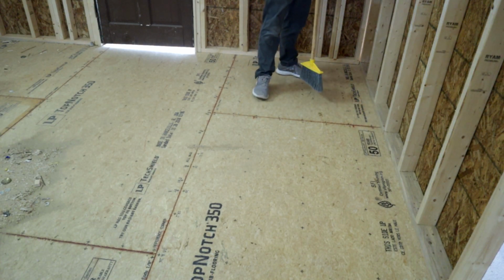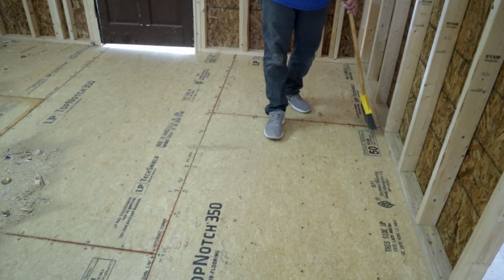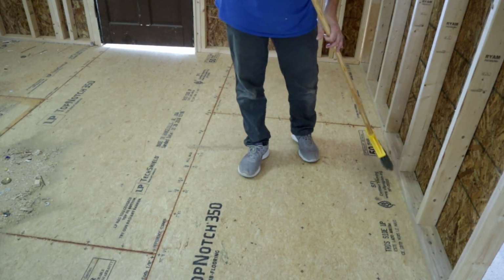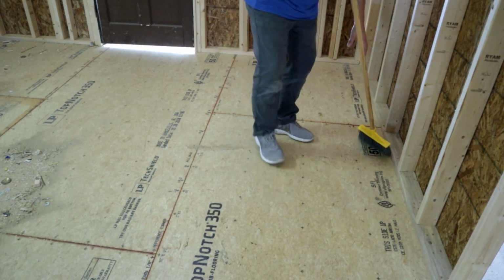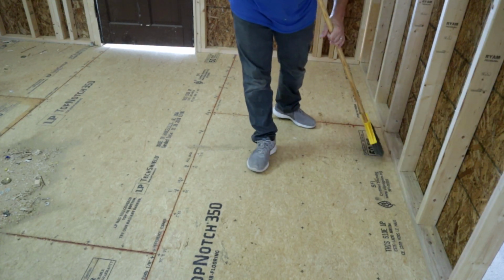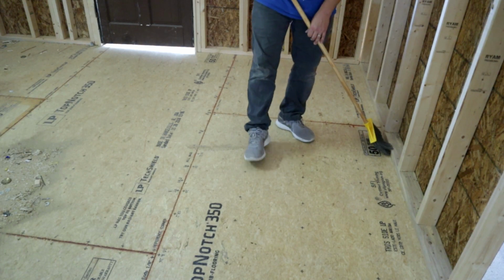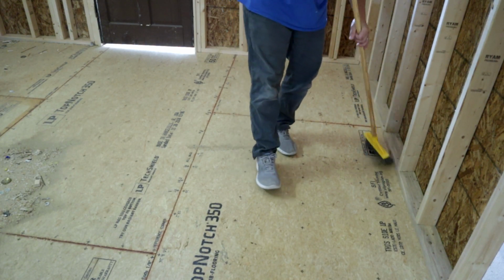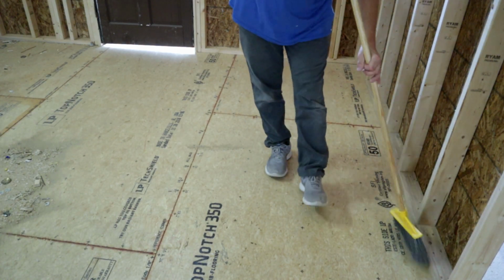So this is what I do, and this is what I stress to every single one of my helpers, to use my broom sideways just like that. This gets underneath the sheetrock at that particular angle right there, and I never will go long strokes like that, okay? After so much of that right there, stuff is going to start falling out the back of the broom, okay? It's very important to do short little strokes at a nice angle. Notice my broom is almost, I'm not doing it like that, okay? By no means. I'm angling it almost flat with the wall so that it's going to fit underneath the sheetrock and pull stuff out. I'm doing strokes maybe about 6 inches or so, 6 or 8 inches with my broom, okay? And that is going to get everything out, okay?